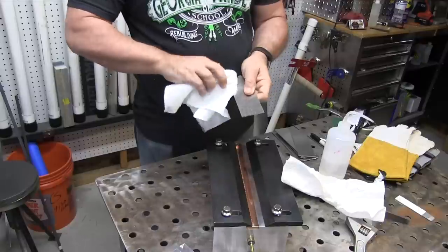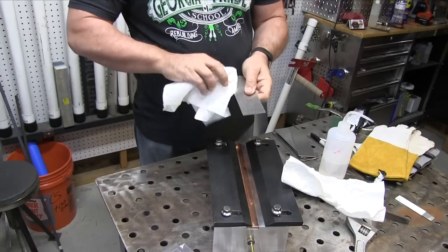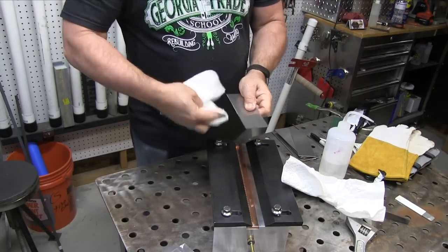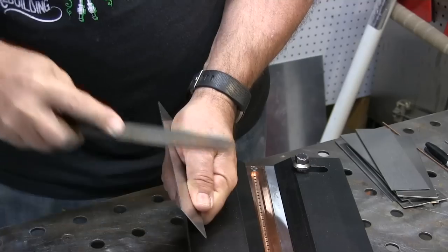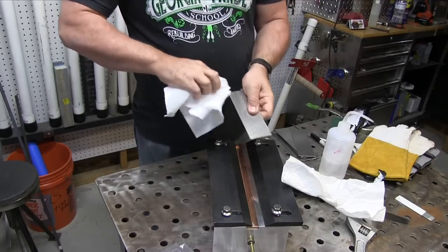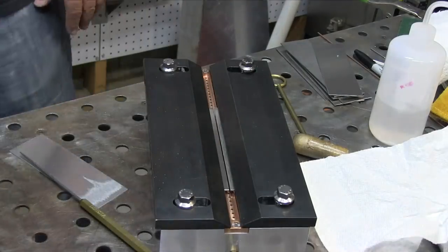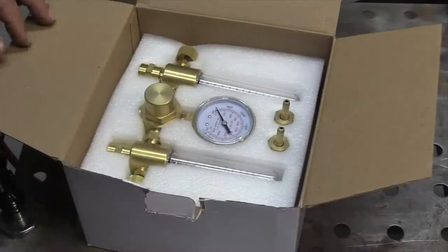Just for this demo joint I'm using 304L stainless. That would be rare to do in aerospace testing but it's just a practice joint. The very first thing I would do when taking a test like this is wipe the metal down with acetone. Next I would use a clean dedicated file to clean that sheared edge. Some metals require some sanding. This is just pretty clean — it had a peel coat on it — so I'm giving it another wipe with acetone and then I'm ready to weld.